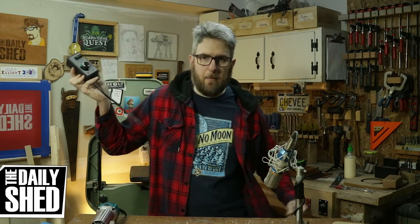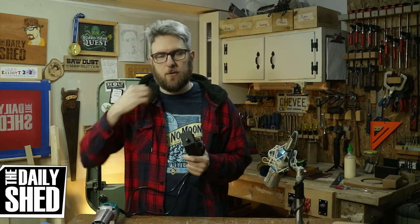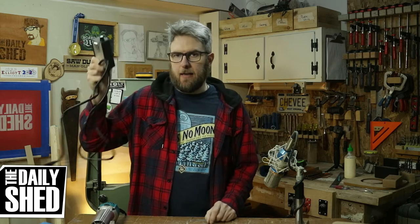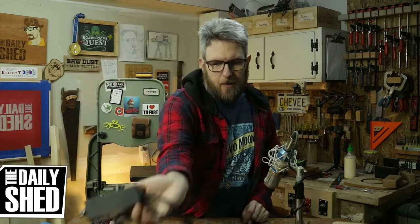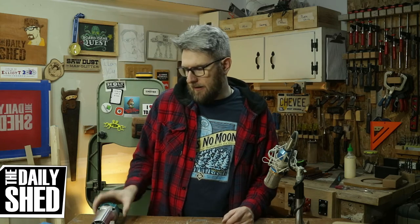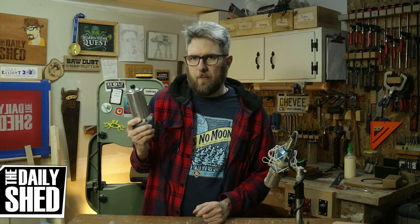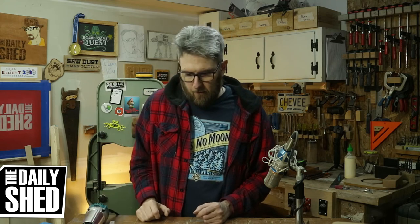The real reason I'm excited about it is because I've purchased this for my Craftsman router table. It has an old magnesium-body Craftsman router that does not have a speed control. When you're working with some router bits on a router table, you really need to be able to turn the thing down to keep from burning things — especially using a trim bit on hard maple, it'll burn. So hopefully I can turn this down a little bit and avoid that.